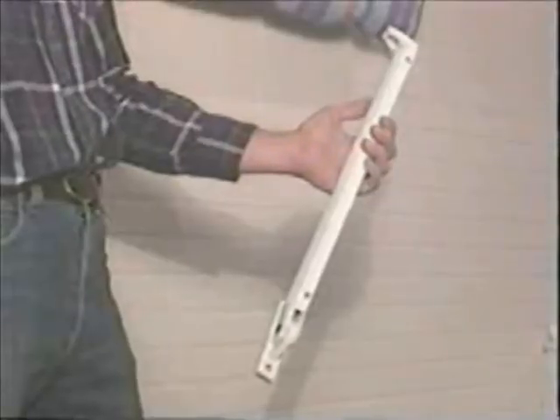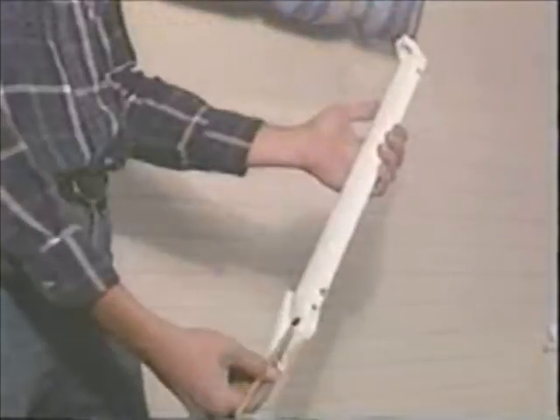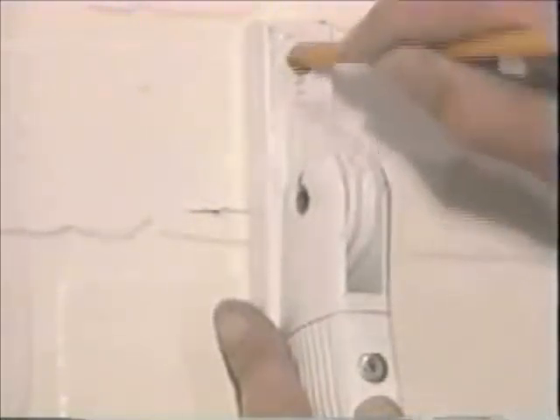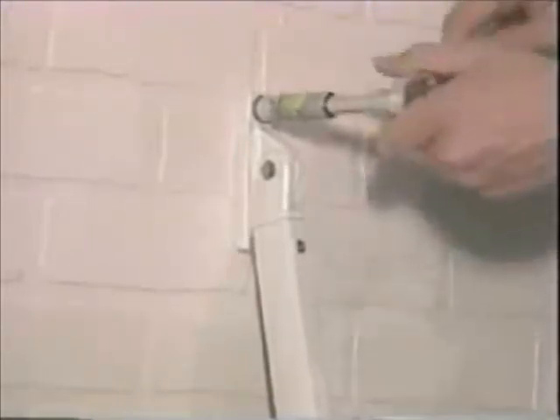You are now ready to install the awning arm. Measure the length from the front of the arm attachment to the pin on the back of the arm wall attachment. Then, starting from the bottom of the end bracket, measure down the same distance on the wall, and subtract half an inch from the measurement and mark. The mark on the wall should align with the center pin on the arm wall bracket. Then mark your hole in the top of the bracket and drill. Then bolt the top of the bracket securely to the wall. Repeat this procedure for the second arm, bolting only the top of the arm bracket. Make sure that the front fixtures of each arm are pointing toward the center of the awning.